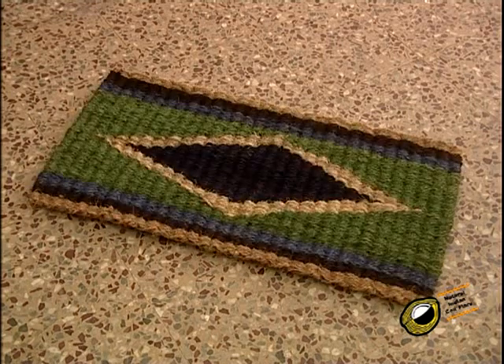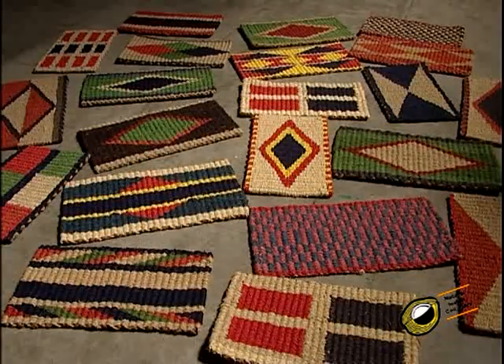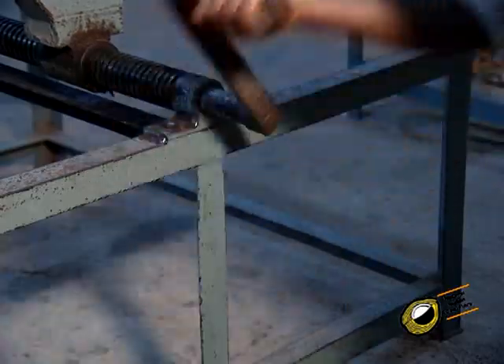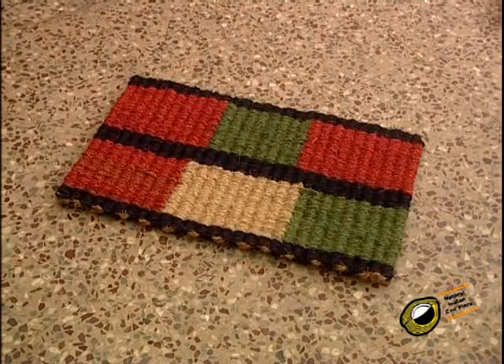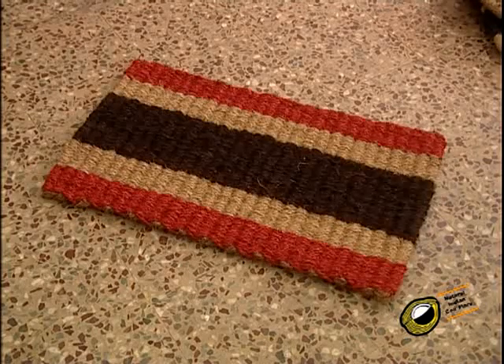The corridor mat is also known as Dutch mat or Hollander mat. It is produced with the help of a wooden frame and a pressing device. It is a mat in which both warp and weft strands are continuous without tucking in or binding. It is a non-brush type and the weaving is of carpet weaving in which the weft is predominant and warp is concealed.